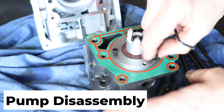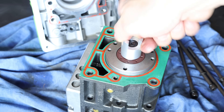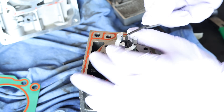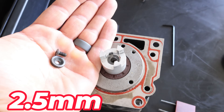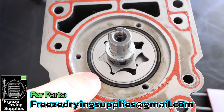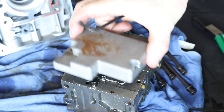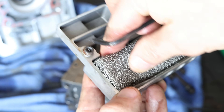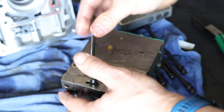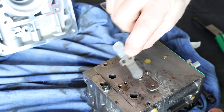Remove the three 3mm allen screws to access the collar and the outer seal. You can turn this by hand and hear the pump movement — it should move freely and sound smooth. Before taking the collar off, remove the three-pronged drive wheel using a 2.5mm allen key. After that's off, remove the collar to access the replaceable seal and the replaceable o-ring. Then use a 4mm hex to remove the intake for the pump, which gives access to the mesh screen filter — it's metal and can be cleaned. This filter stops large chunks from being sucked into the pump. With the intake removed, you can also access the other small inlet ports, also 4mm, to clean them and check for blockage.